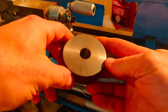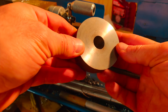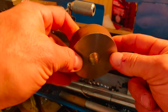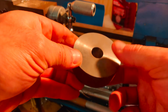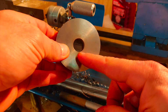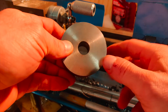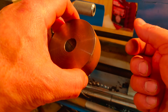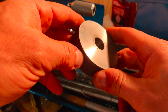If you remember from the heavy steel taper video, there was one part where I used the taper hammer and in order to make that work I had to make a test piece. This is that test piece — it's basically a heavy steel piece with a hole in the middle. I'm going to try to utilize this as the weight for the puller. Since I already have this, I just need to make a piece that fits in this hole, has some kind of stop on it, and also has an M12 thread on the end to screw onto where the injector line attaches. That should make taking these injectors out pretty easy.